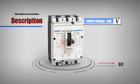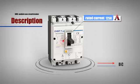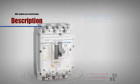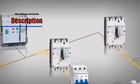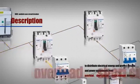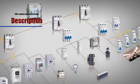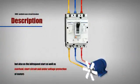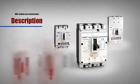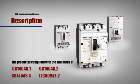The circuit breaker is suitable for AC 50 Hz rated voltage 690 volts and below, and DC systems rated voltage 500 volts and below, with rated current up to 1250A and below. It is used for connecting, breaking and carrying the rated circuit, and can reliably protect lines and electrical equipment under overload, short circuit, and under voltage circumstances. It can also protect motors under infrequent start, overload, short circuit and under voltage.